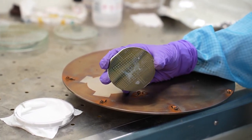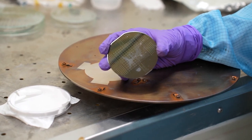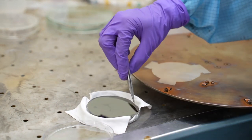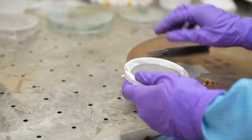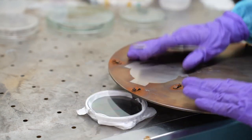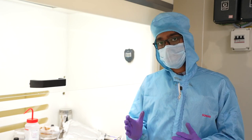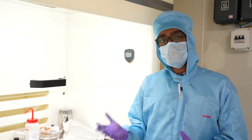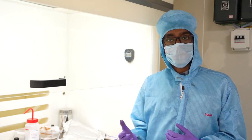Probably you can see the patterns on the wafer as well. We will use this for fabricating the device, and for further processes we will send it for lift-off. We will keep the wafer safe in the Petri dish. Better to avoid touching the center parts because most of the devices are there. We already closed it and will keep this in the desiccator again. This part is done. Our next thing is to clean the chuck, which we will do offline. We saved the wafer for our next process and kept it in the desiccator. Our next process will be lift-off, where we will remove the unwanted part of the deposition and get the pattern. We will come back with the lift-off process in the next module. Till then, take care. Thank you.